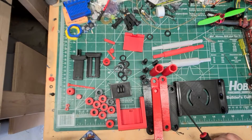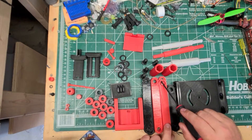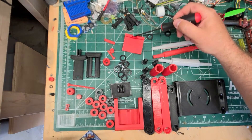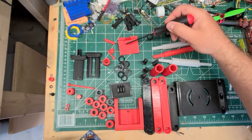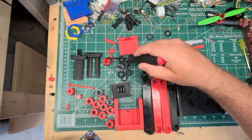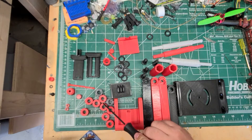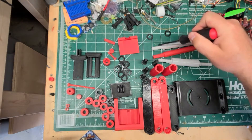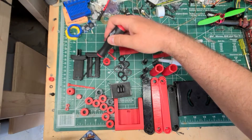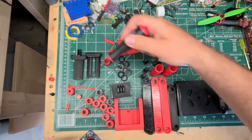There are two different types of extender legs. You'll see one type has the lock washer grips on both sides and the other side has an inset with a hex cutout so that it will feed onto this bolt. The next pieces you'll need are the actual clamp at the top, which is these two parts. As part of the clamp, you'll have to print a printed bolt, a nut, and a capture device for that bolt. Then you'll need all the nuts to secure the bolts together so that you can lift and collapse that mechanism. The final piece is the cell phone holder — a clamp mechanism with its own bolt, nut, and capture device.